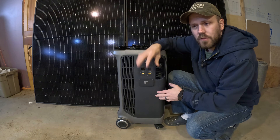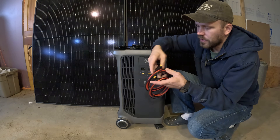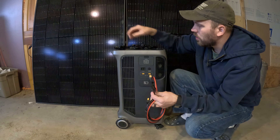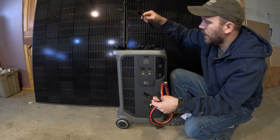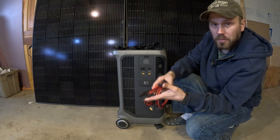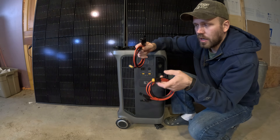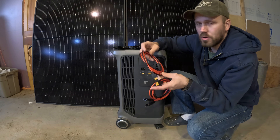The other thing you'll need if you want to do any solar is the adapter cords. This is the XT60 — it plugs right in here and then goes to your MC4 connector, so you can hook your adapters up to that and then connect your panels. I'll put a link in the description for these as well. If you're not buying the linked ones, make sure you're getting a 30-amp rated cord, which would be a 10-gauge cord.